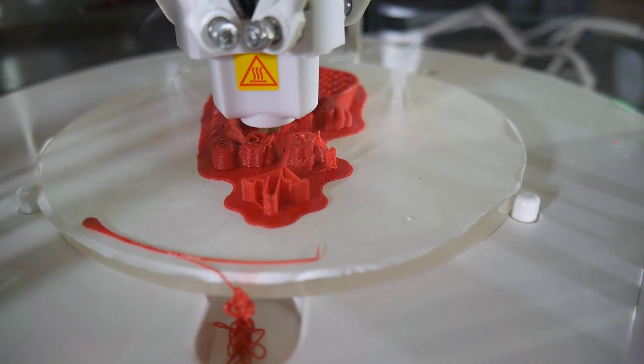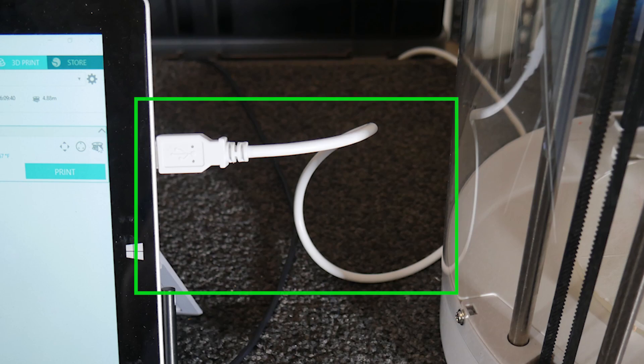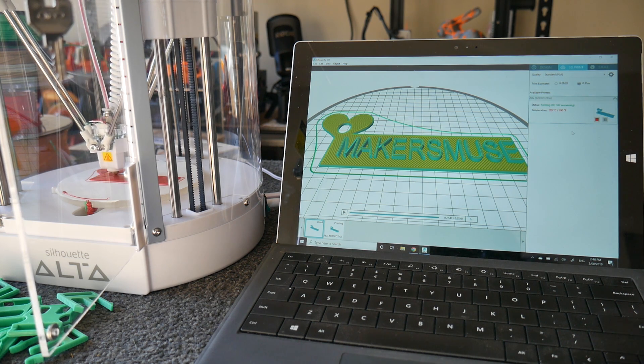Here's one big fat gotcha: this 3D printer does not cache the entire print job before starting, and you cannot attach storage media like pretty much any other 3D printer on the market. You must print tethered — meaning you must have a USB cable connected to this machine, back to your computer, for the entire duration of the print. Not going to sugarcoat it — this sucks. Especially if the print job is going to take hours. In 2019, it's almost unheard of. If your laptop goes to sleep or updates, which Windows 10 does about three times a week, your print will be ruined.